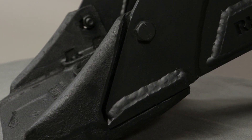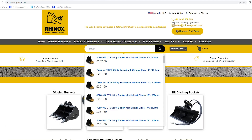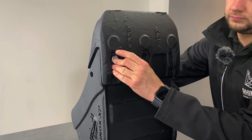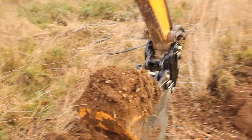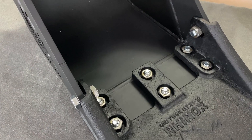Rhinox has a product specifically for this application called the Unitusk. You can find it on our website under our products. It's like a gummy guard, as some people call it in the trade. It bolts onto the bucket at the front and it's shaped like an old bucket, so it's meant to deflect away from a service if it hits or comes across it, rather than drag it, pierce it, or rip it out of the ground. It's a good product — definitely worth having a look at. It bolts on and strengthens the bucket, so it's a brilliant product if you're doing utility work.